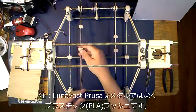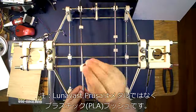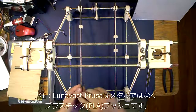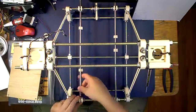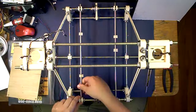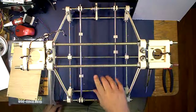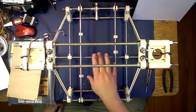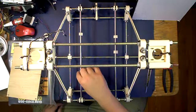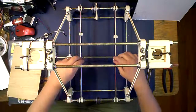For this version, I made a little clip with a brass bushing glued in the middle of it, so it supplements or replaces the actual brass bushing. First thing you're going to do is slide your two 406 millimeter smooth rods in. Once they're in, if you have brass bushings you're going to go ahead and slide them on. If you have PLA bushings you'll clip them on later, but because of the ones I used I have to actually slide them on to begin with.